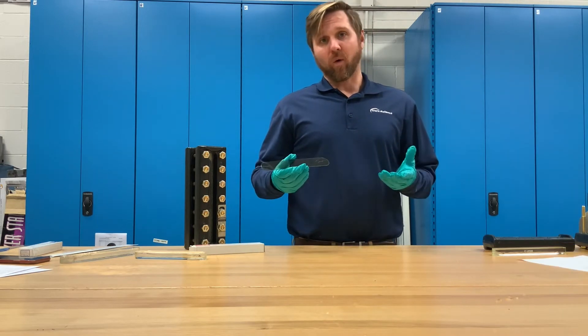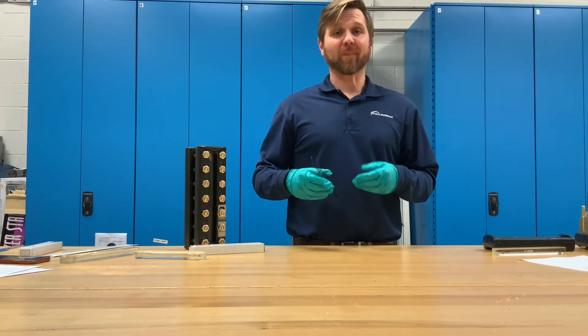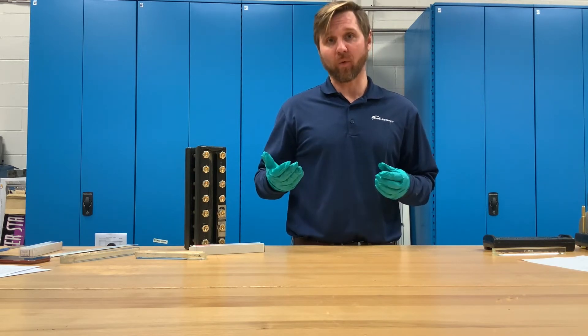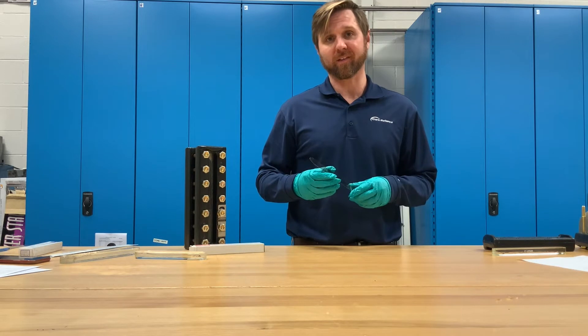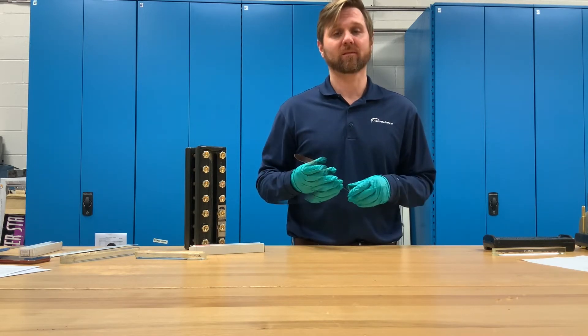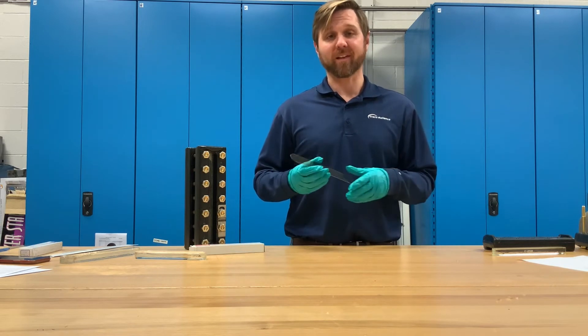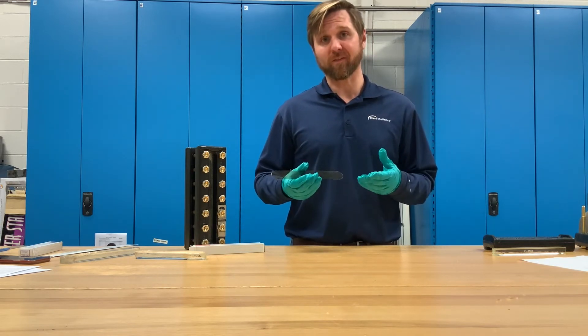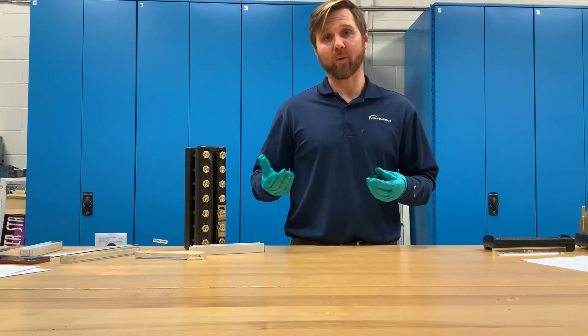Mica is rated for quality based on ASTM D351. Mica is assigned a V-rating, basically 1 through 12, based on the visual characteristics of the mica — 1 being the highest quality and 12 being the lowest. There is a table of properties that looks at waviness, hardness, stain characteristics, and other visual defects. It could be complicated, but we'll give you a few tips.